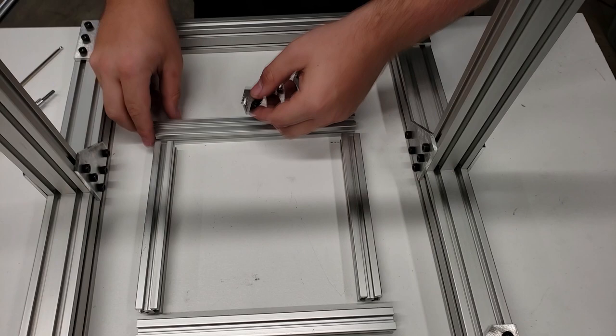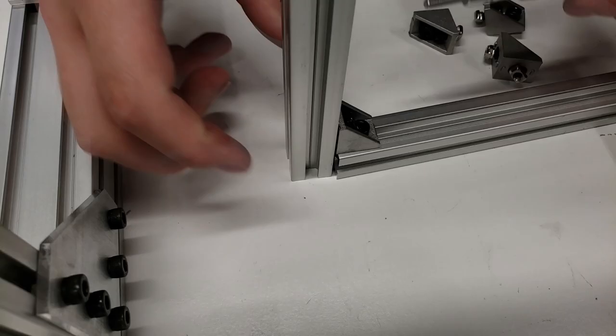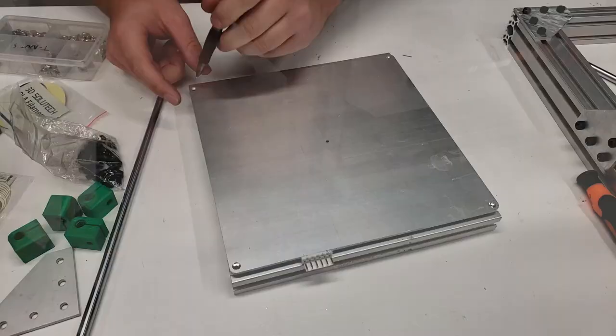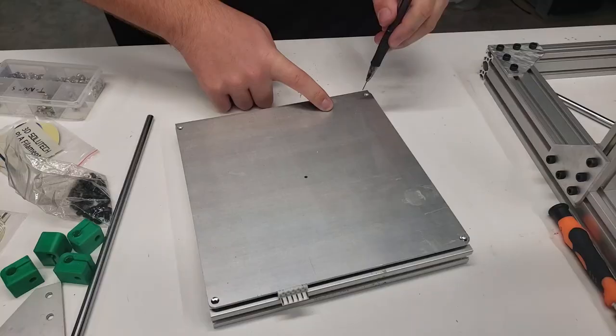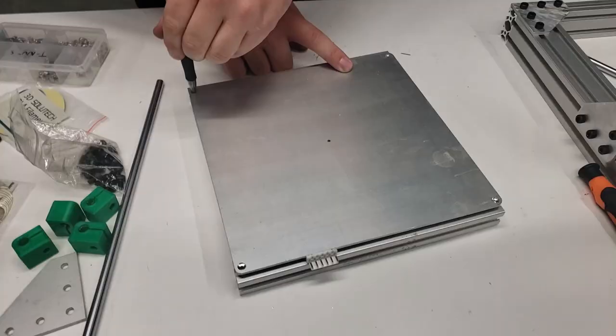This step simply requires you to use the 190-millimeter extrusion — that goes on the inside of the 220-millimeter extrusion. Once again, you're going to attach it here with the corner brackets and M5 screws. Once assembled, take your print bed and mark with a pencil exactly where each one of the screw holes lines up in the tracks. Then take that to your drill press and drill some holes. Each hole should be drilled in the center of the track right where you have each dot.